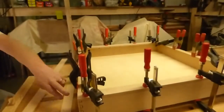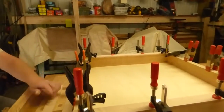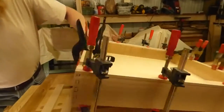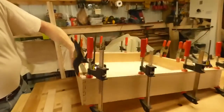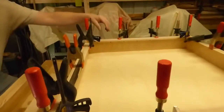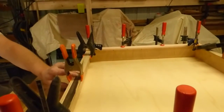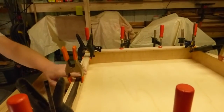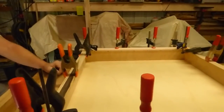Some of this made already. We made the frame up, dovetailed them together. And you can see that in a previous video. We'll click a link to it. And we had the back cut, so I went ahead and glued that on and shot some brads in it. And I had to do a little planing here and there to get that fit perfect. And put on the top and bottom face frames, and I put a support underneath for the side pieces. So I gotta wait for this to glue up so I can attach those. And then we can start on the doors after that.